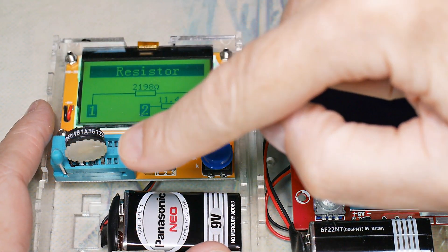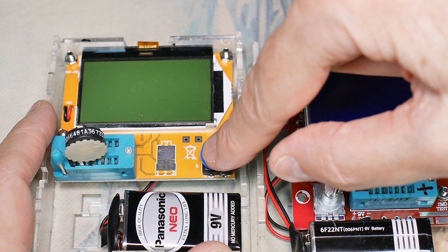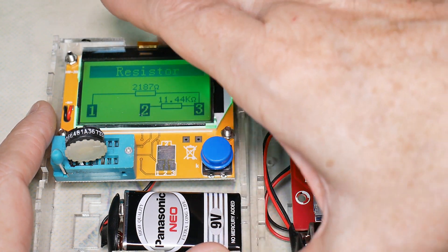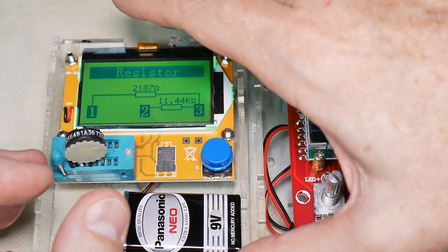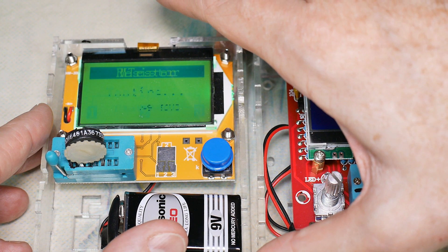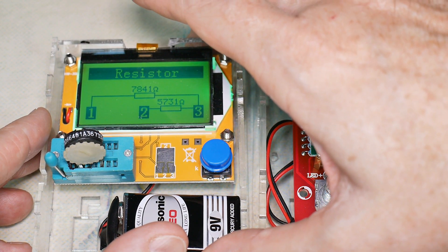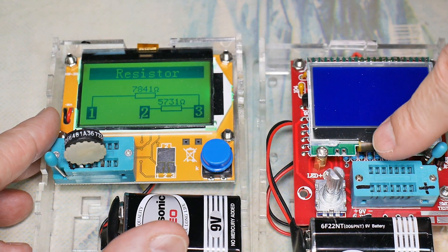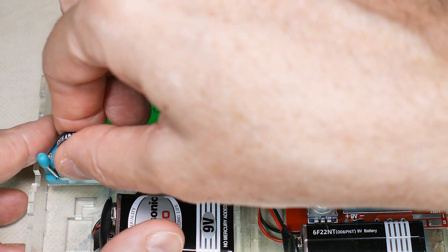The readings are — theoretically, if you can contort one of these variable resistors in place, it will measure the different legs of it. So I've got one leg between one and one, one and two, and one and three. I push this and it tells me 2187 and 11.44K. So this is supposed to be a 10K pot. Let's see what happens when we turn it to the extreme — it gives me a little different values: 57 and 78, so that's 13 or 14K. So it won't give you accurate measurements if the pot is turned all the way one way or the other — the instruction manual tells me that. If you're going to measure a pot, you have to put it somewhere towards the middle.